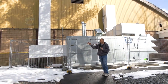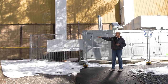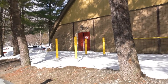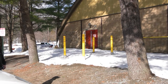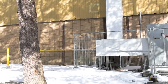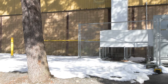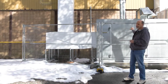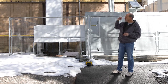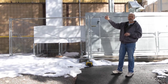This unit is propane-fired. The old above-ground propane tank was too small — so we installed a 2,000-gallon underground propane tank, marked by four bollards on the ground. A propane line runs to the building where a green first-stage gas regulator reduces pressure for the CDI unit, which has a secondary regulator maintaining proper water column pressure to fire the gas. The same propane line continues through the rink into the boiler room to fire the two boilers and the gas water heater.